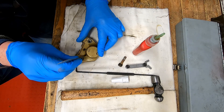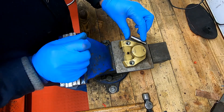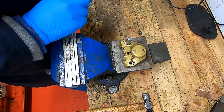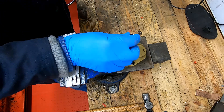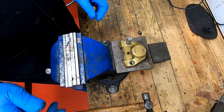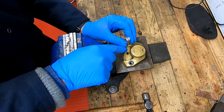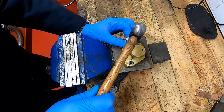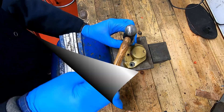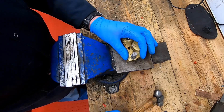Just bring that again just below the casting there so our inserts are in position. Now we can just drop this pin into the insert, then put that sleeve over — it just drops down and stops everything from moving apart. We'll get this into position and really it's just a question of tapping these home. Drop that over, make sure it's in a good position.